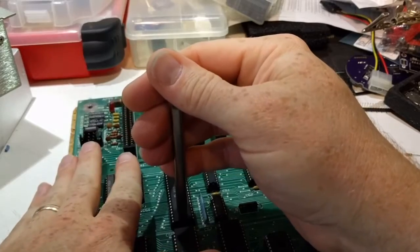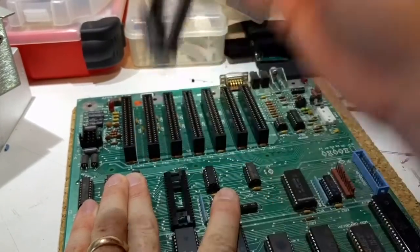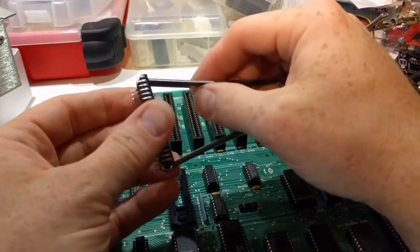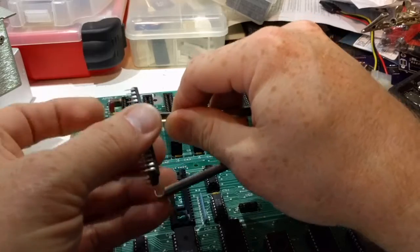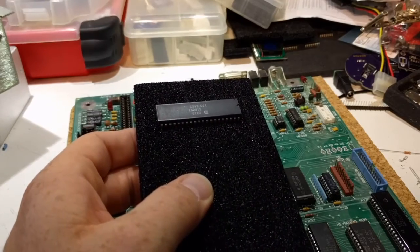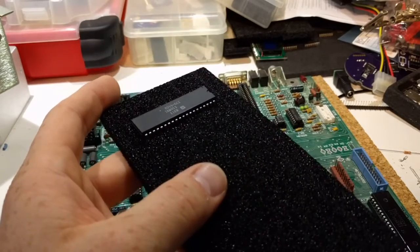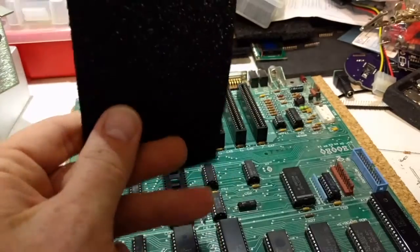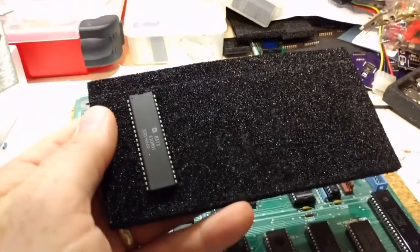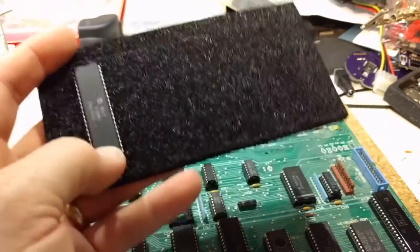I'm not a big fan of the chip puller, but it does work to go straight up off the board without bending any of the pins. I'm saving the chip on some recycled conductive foam that came with other components — it's a good way to protect it from static shocks and store it nice and flat for later use.